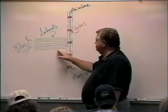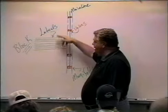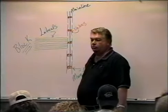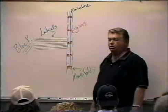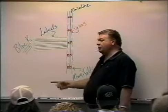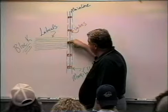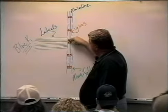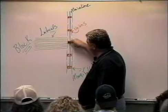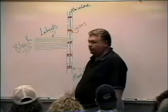The blocks themselves have all these laterals — in this case I've drawn nine laterals. Say I had 450 gallons a minute in a block; each lateral would run 50 gallons a minute. I can size my manifold because the manifold itself is going to have different flows. It starts at 50 for this piece of the manifold, then the next piece is at 100, the next piece is 150, then 200, and then the middle one hits right on the valve.